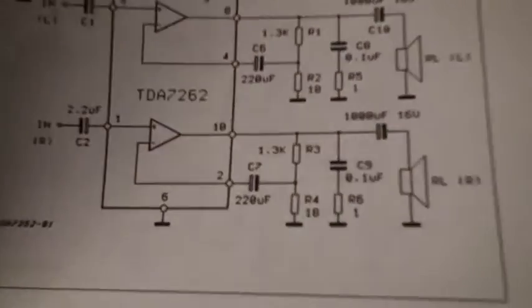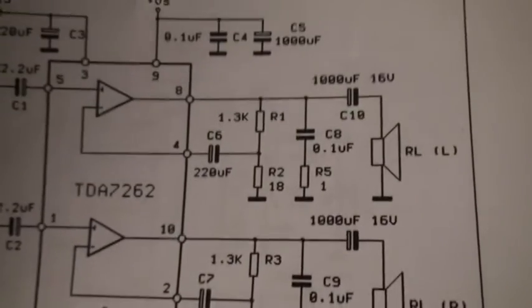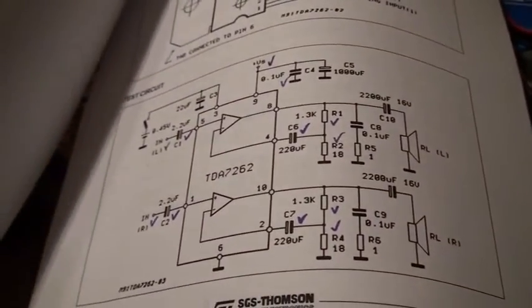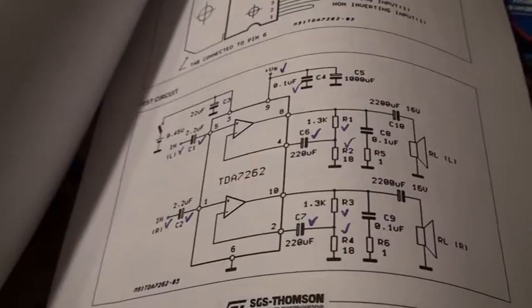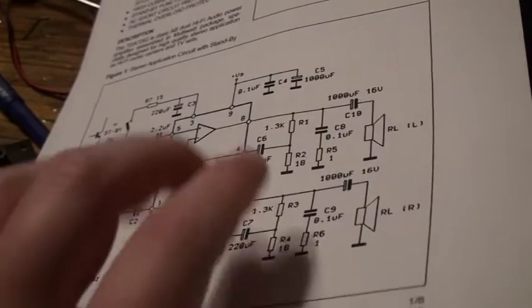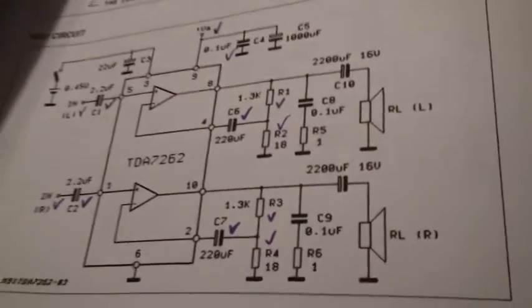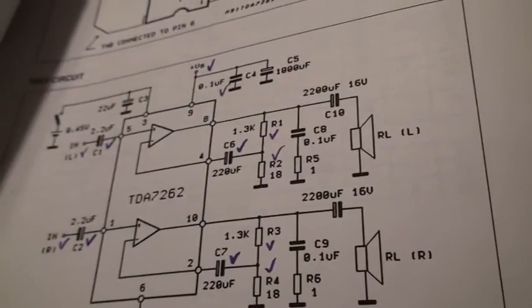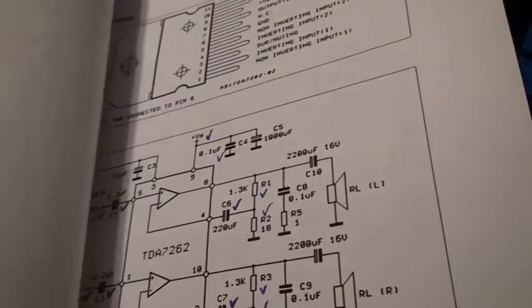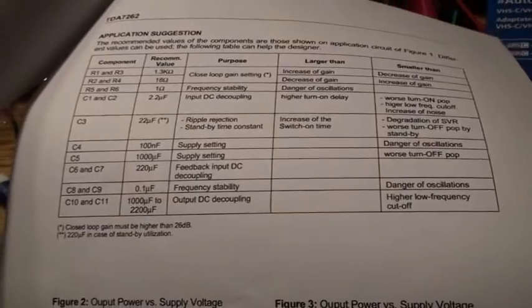But there is the recommended circuit — rather simple, not much going on. There is also the test circuit. I actually got the two confused; I actually built the test circuit, but they are identical except for the speaker output capacitors. The application circuit gives you the cheap version. The test circuit gives you the good 2200 microfarad capacitors. This one has just a thousand. 2200 is the maximum.